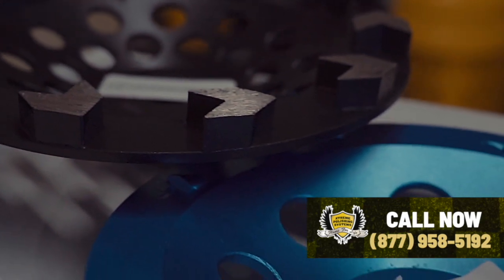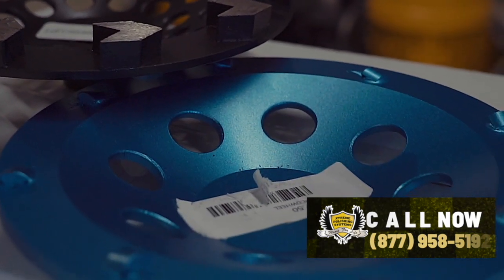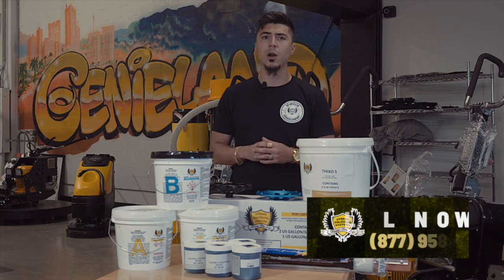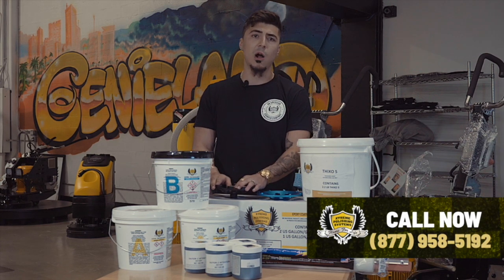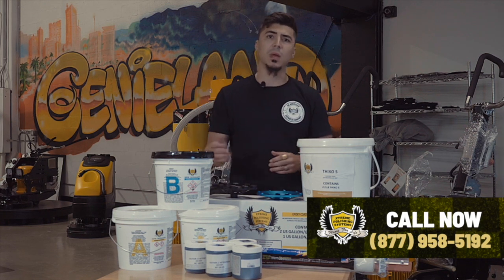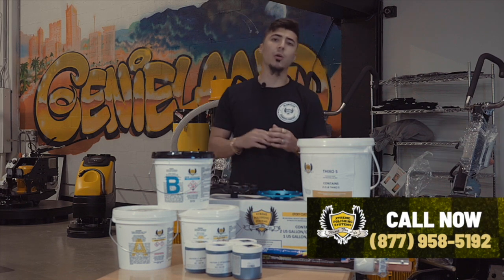Because dust is one of the things that's worst for epoxy. It's a big bond breaker. So you don't want any particles of dust, no water on that floor. Once you go ahead and grind the floor with your 30 grit metal, you're gonna clean it with denatured alcohol, wipe it down with a microfiber pad, vacuum it again. Like I said, make sure there's no dust particles. So you got your prep done.